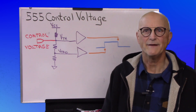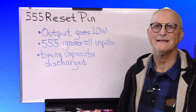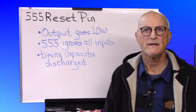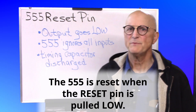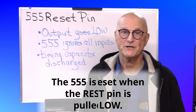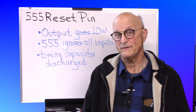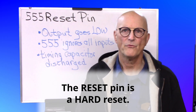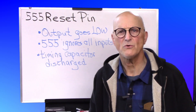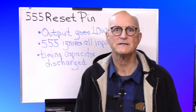Now, on to the reset pin. When we talk about the reset pin, the pin is labeled simply 'reset,' which is kind of a misnomer in the more modern pin labeling nomenclature. The reason I say this is because the chip is reset when this pin is pulled low, making it actually a negative logic input — so technically it is a not-reset input. The reset pin is a hard reset, meaning that regardless of the state of other control pins such as threshold or trigger, the operation of the 555 comes to a screeching halt when it is asserted.